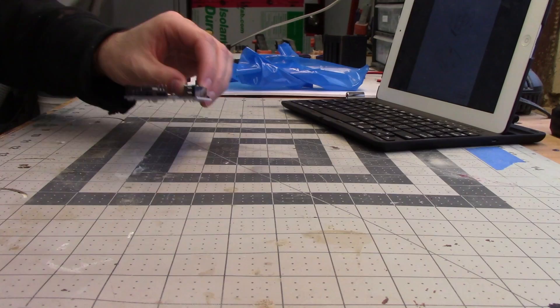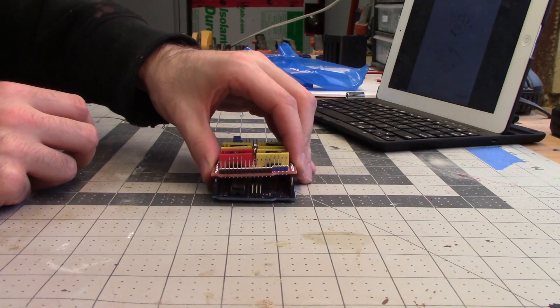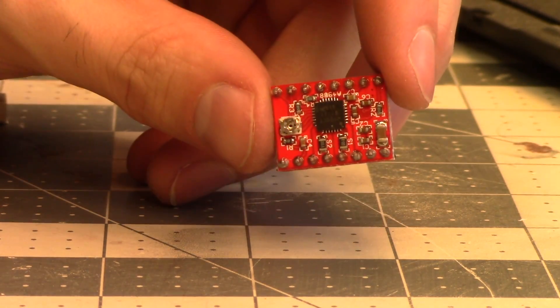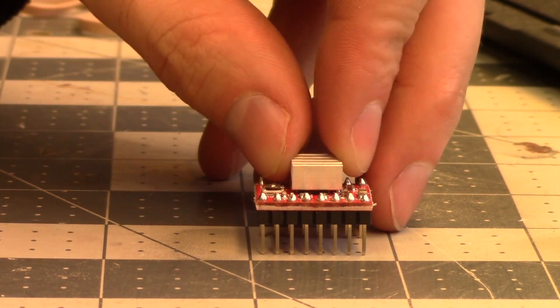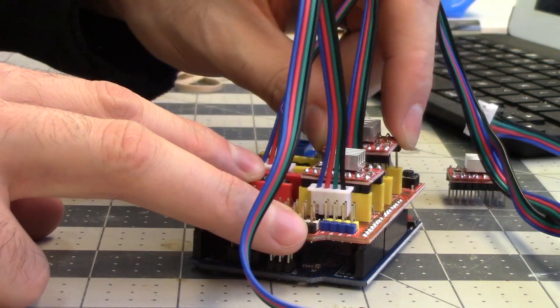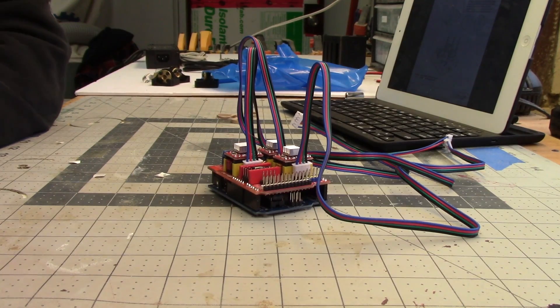The physical aspect of the build is finished and it's on to the electronics. The electronics for the system are primarily comprised of a stock Arduino with a CNC controller shield on top. This here is a motor driver — this is what's going to turn signals from the CNC shield into PWM signals that will drive our stepper motors. They're going to get kind of warm because they're turning the stepper motors on and off really quickly, so we need to add a heat sink to each of these.